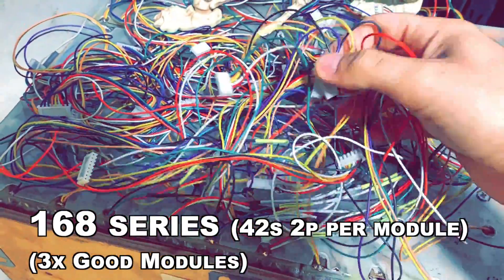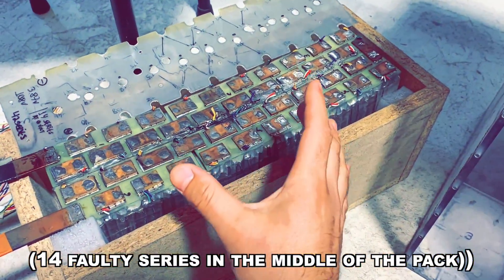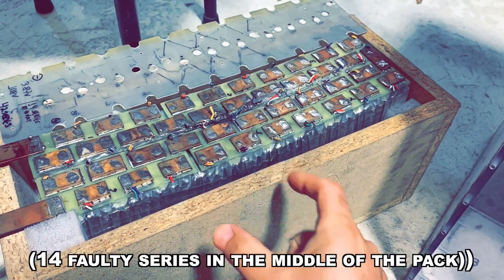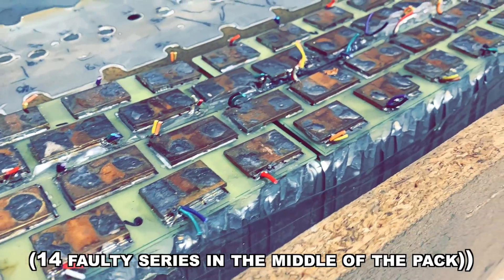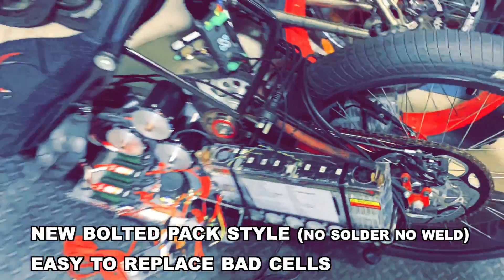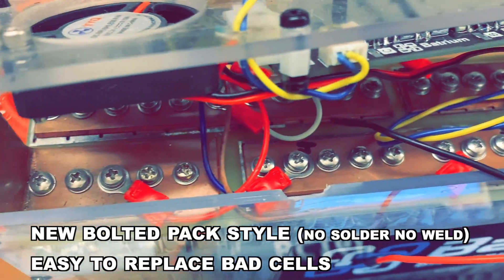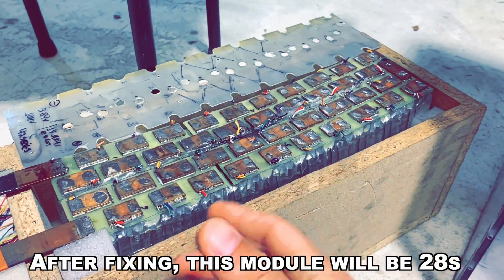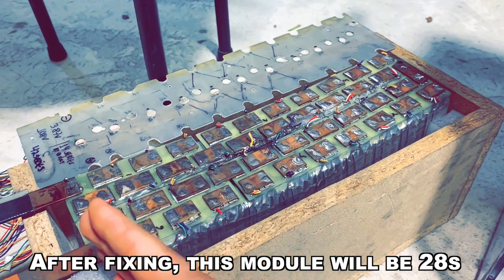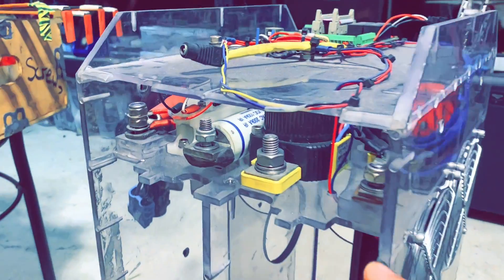There's a lot of work to do — look how many BMS wires to fix. These modules are actually good but it's a mess. The battery management system was draining the middle cells down to zero volts, losing 14 series right in the middle. Back in the day everything was soldered, so it's a lot of work shifting cells around. My trike uses bolted busbars done by Chris Johns — bolts and nuts underneath, like a sandwich. There are 42 series at the moment and we'll probably lose quite a few, but I've got the tools — big soldering iron, everything.